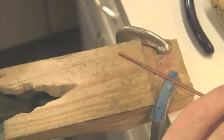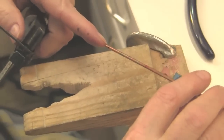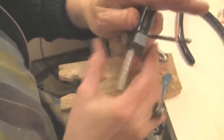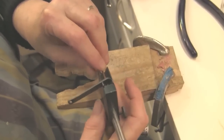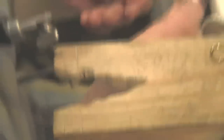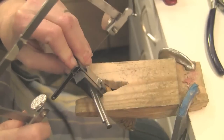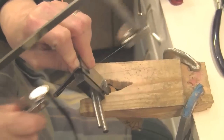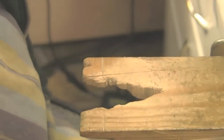I know of two ways that are comfortable to cut tubing. If you do not have these tools, you could probably do it without them, but you're not going to end up with as square a cut. This is my favorite tool to use. I've already preset it to the size and I fit it into my bench pin like this. The blade goes in between, and then we cut the tubing — try not to lose it on the floor. Got it.